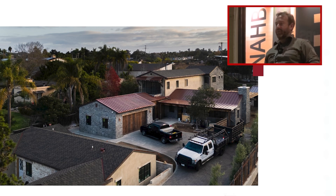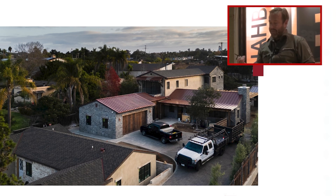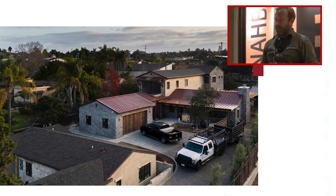Is this a difficult thing to accomplish? If you want all the benefits of exterior insulation — for fire resistance, for comfort, for sound — the steps you have to take as a contractor are pretty minimal. You add a three-inch screw with some plastic washers, and you tell your contractor to use a two and a half inch staple versus the one and a half inch they usually use. Other than that, you can go at it the same way as any stucco application — whether a one-coat system applying the lath directly onto exterior insulation, or a three-coat with two layers. The product looks the same, looks beautiful, and there are a lot of benefits going on the exterior too.